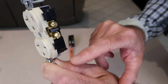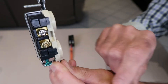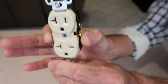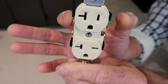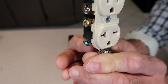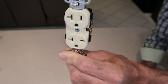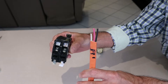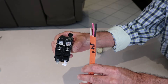On this receptacle there are two brass terminals that are jumperd — the other side has a brass for the hot and a silver for the neutral. Your two hots come in here, neutral here, and ground here. That gives you 250 volts on one outlet and 125 volts on the other outlet, using a two-pole circuit breaker and a three-conductor cable with ground.